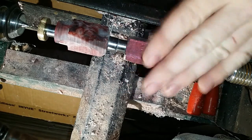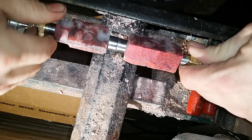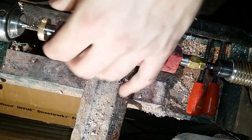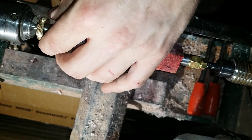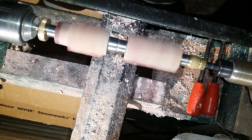So let's show you how to turn this pen. Make sure it's real good and tight — tighten her down real nice so it doesn't slide or chip. Bring your tail stock up. Try not to shove it in so you don't bend the mandrel or ruin your live center. Just get it locked in nicely and turn it on.